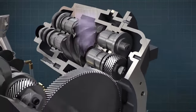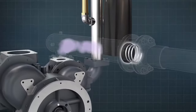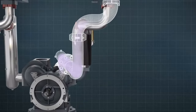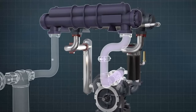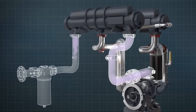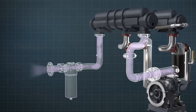The compressed air exits the air-end via a delivery silencer, then through a non-return valve. The air then passes through a final second stage air or water cooling process to ensure the delivery air is at the right temperature. Then, after a final journey through a moisture separator, the air is ready to exit the compressor at the delivery port.